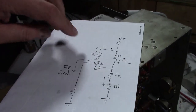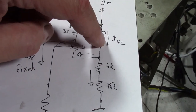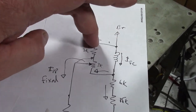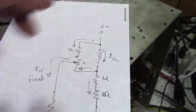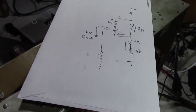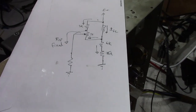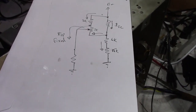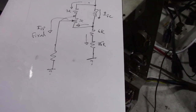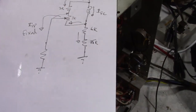If this is bad, how could the focus control do anything? Well, all the current was always going through here — down that way — none of it was going down this path. A good chunk of the current is supposed to be going this way, and that's why we had too much going through the focus coil. That's a lesson for me: I just assumed the problem had to be esoteric — something weird with biasing of tubes, higher line voltage, this and that — when no, one of the brand-new parts critical to the operation was bad. Simple as that.